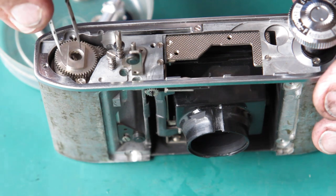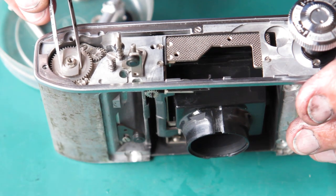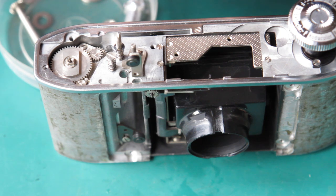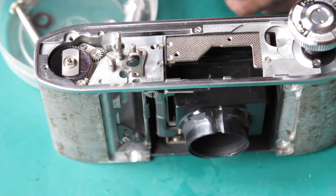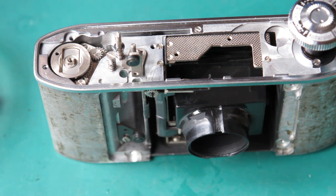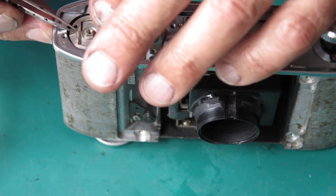The gear that runs on the top of that shaft — I'll just put that in place and wipe it out with a little bit of synthetic grease; rotate that, that's fine. This leaf spring doesn't really require much lubrication, but I normally wipe it with some synthetic grease anyway — just a gentle wipe. It helps preserve it against corrosion; you don't want any corrosion on spring steel, it's always a bit prone to corrosion, especially the higher carbon steels. I'll just pop the advance lever under there to support this while I'm getting the other components in place.